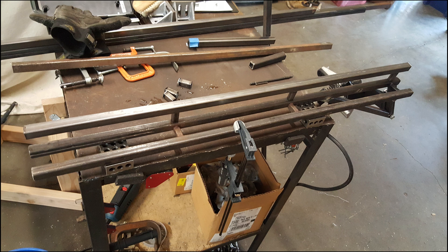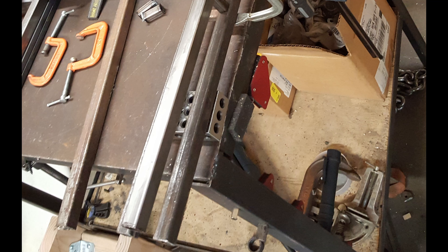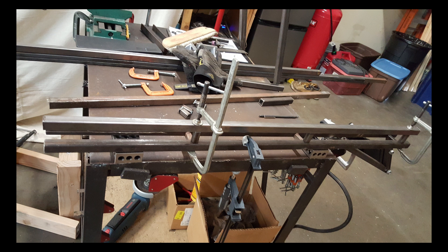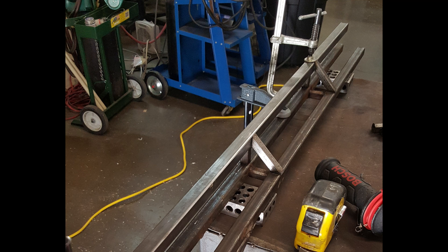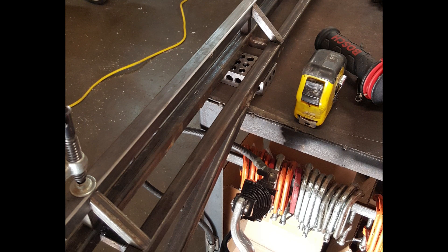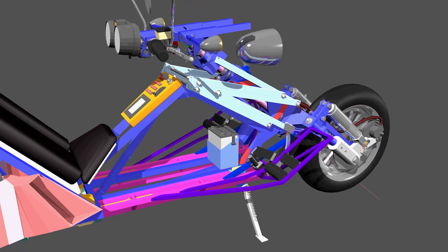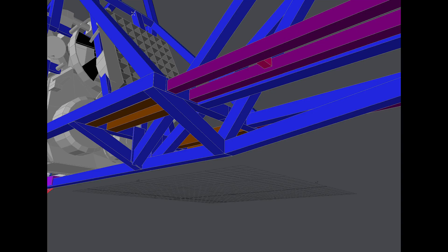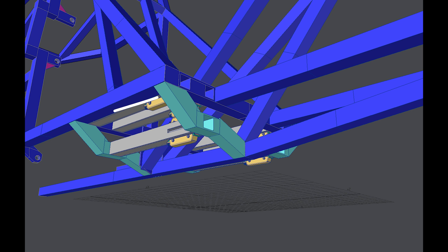I then moved on to adding the third rail to the foot rails. This part would be pretty easy — just cutting out a long tube and welding it into place. Where these foot rails intersected with the frame, though, there were only two slots for those original two parallel three-quarter inch tubes. So the frame would need significant modifications to add a third slot for that third rail. The intention is to have these foot rails be adjustable so they'll slide forward or back and accommodate people of different heights. The frame modification necessary to support the third rail is done at a later time, but here you can see what it will involve. These two parallel purple bars are the existing foot rail frame. In order to physically support that third frame rail, the bottom angled piece would be cut and split into three pieces with a short horizontal piece in the middle with an opening for that third rail.